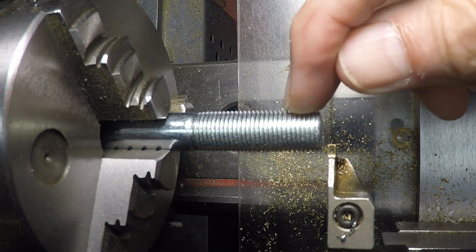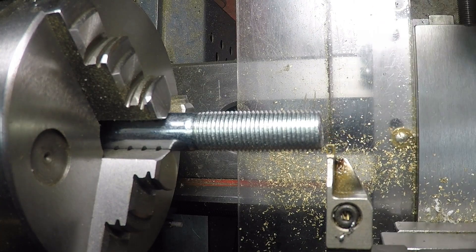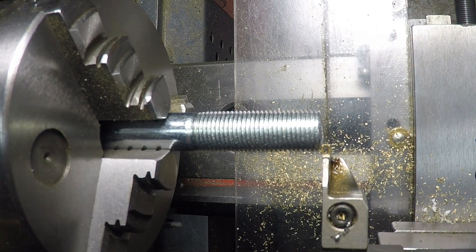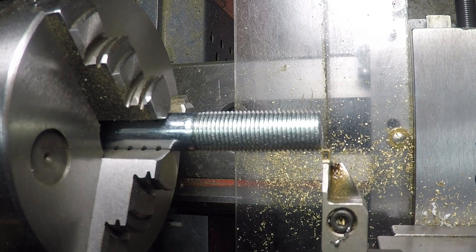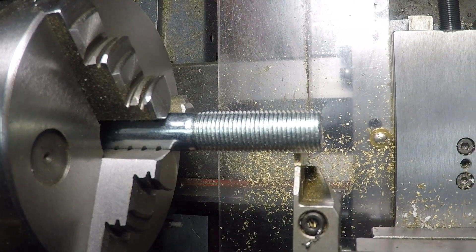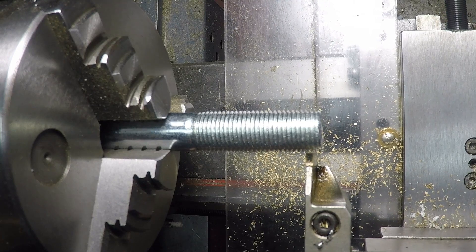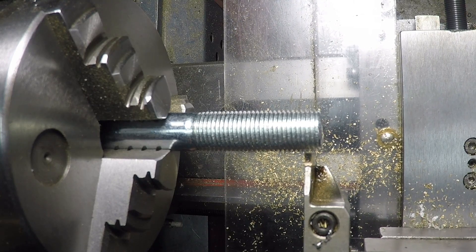I know I need to take a half inch off the bolt here, so I'm going to take the left edge of my cutting tool, set it up there, zero my digital readout for the carriage and then move over 0.5 inches. Oops, too much. Right about there and I'm going to lock the carriage down and make a cut here.